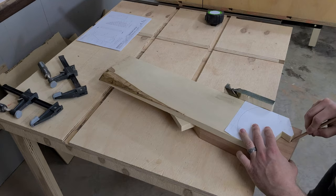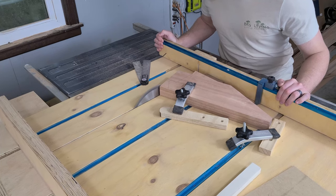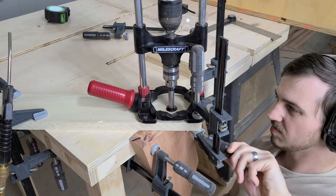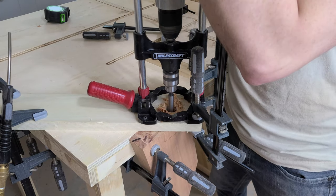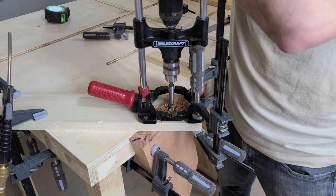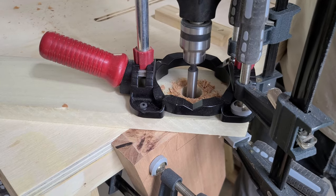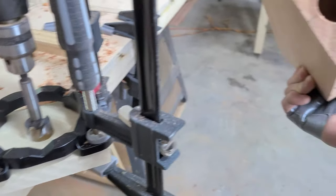We quickly trace the pattern onto each of the pieces. Before you start cutting the pattern, we want to go ahead and drill as much of the hole for the positioning rod as possible. This will be much easier to do if you have a flat surface to reference, so we start by chopping a flat, angled surface on the end of each of these boards using our crosscut sled. We can now clamp these pieces to the side of the table and align the cut edge with the surface of the table. With the addition of a secondary board, we have a mostly solid base for our portable drill press to reference. All we have to do now is mark the hole location, drill the pilot hole, and then drill the large hole for the rod. Thinking through the order of operations on tricky parts like this can really help save you time and headaches later on.